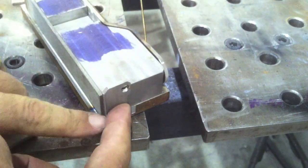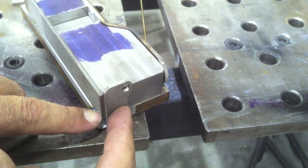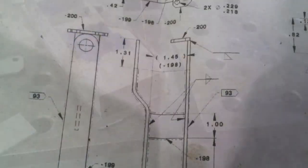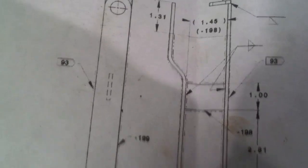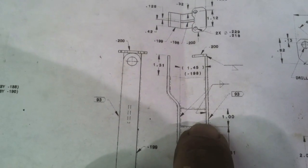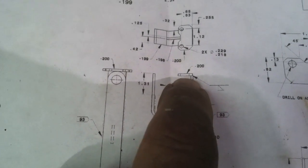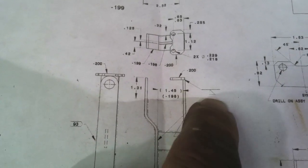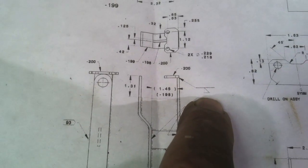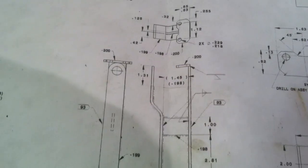All you have to do is line it up with some stops and weld it. Now this last tab that goes through — normally I would fit it to an outside corner weld to get complete penetration, but the drawing shows it flush with the outer member. The weld symbol requires a single bevel V with a flat finish, and there's also a double fillet weld symbol on this spacer bracket telling me to weld both sides. They call for a single bevel V full penetration with a flat finish, so I've got to put a chamfer on it, otherwise there's no way to get enough weld on one side for a strong weld. We're building it to the print.